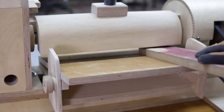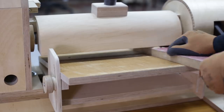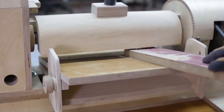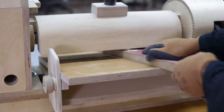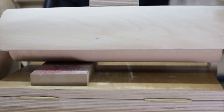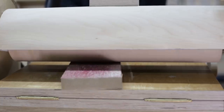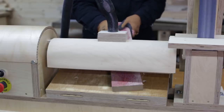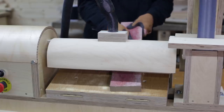I've noticed that for the cylinder to be even, I must remove about 2mm of wood on one of the ends, so it'll take a few minutes before I can make it perfect. The dust cover seems to be working as intended — some of the thickest particles of sawdust do fall on the table, but most of it is sucked out, and I'm not even using a particularly powerful vacuum. Good thing too, because this operation would blow sawdust all over our workshop.